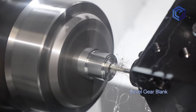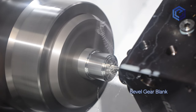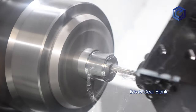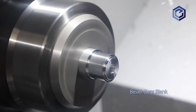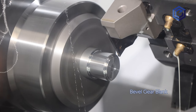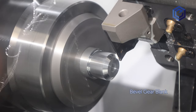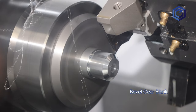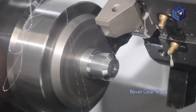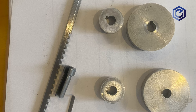Next, we chamfer the backside, followed by the cutoff tool. At this point you can tune your lathe and cut it to size in one go, or you can make the cut with stock to leave. The disc will be large, but a further grinding pass on a surface grinder can achieve a high tolerance in a short period of time. Unfortunately, this does require movement to another machine and another operation.